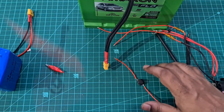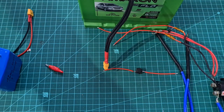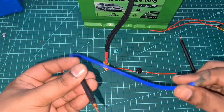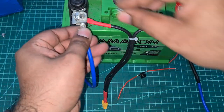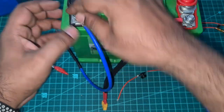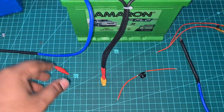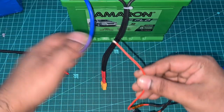Manually tapping is much faster than this relay. If you can get a smaller relay that supports like 50 milliseconds or 20 milliseconds, you could go with that. But the easiest is just go with this manual thing — just tap the switch and it gets connected. For the connections, one lead goes to the negative wire, which is where I've connected one of the spot welding tips.